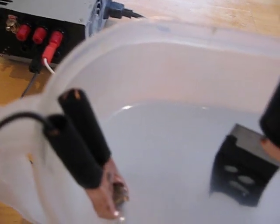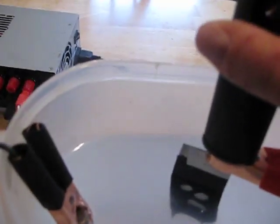As I dip this into the salt solution you should see some bubbles starting to rise from the negative lead. And immediately that negative electrode — the cathode — is bubbling furiously. We've got our anode in there; everything we don't want etched away is masked off or not dipped in the solution. I'm going to stop the camera while this etches because it takes a few minutes.